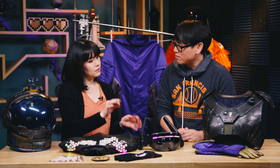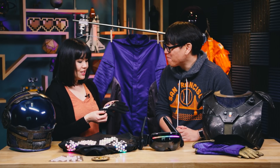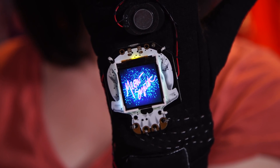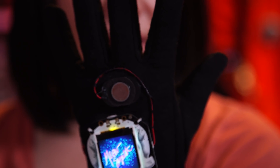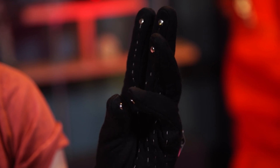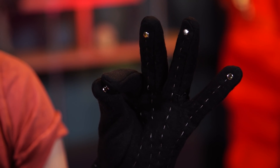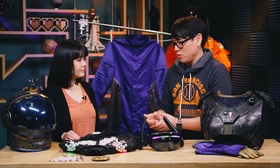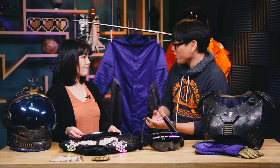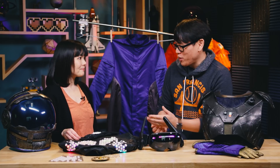For something like this I did a little soldering, but for something like a fabric piece — like this glove — this is a really soft textile piece, and so this has no soldering on it at all. It's all a sewn circuit, so there's conductive thread making all the connections, and all the components are just sewn on with thread. It's kind of just another option if you want to make something that is going to flex around your body. A problem you run into with electronics is flex is your enemy, because your wire is going to break if you flex it too many times. Conductive thread is really flexible and a little bit less intimidating to start with. And your build area is whatever piece of garment you're working on, so you've got to hide the battery somewhere and find a place for components like the controller, which are on PCBs that don't necessarily flex.